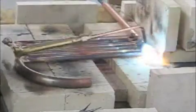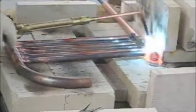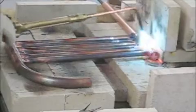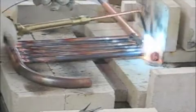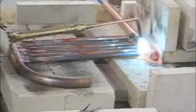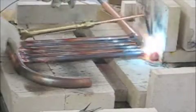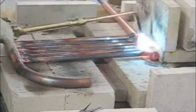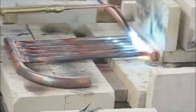Once it's soldered in there, the surface tension of the silver solder tends to hold it right in place until it cools down and hardens right up. I get it to a dull red and then it'll start melting the silver solder. Sometimes I get it up to a medium red, but you don't really want to take it up to a full bright cherry red.